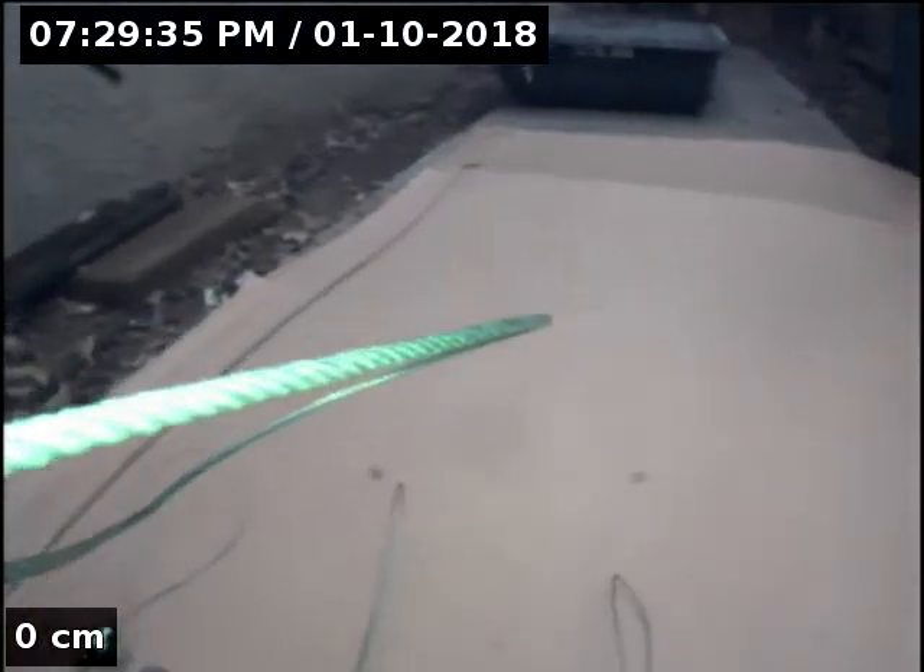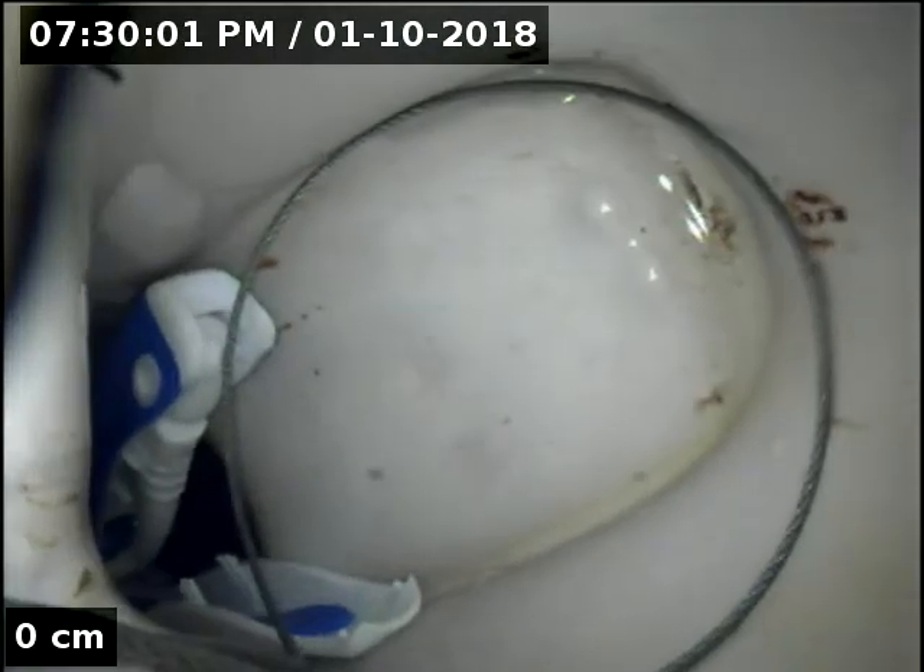We have all three custom-made. We have this little snare that's attached. And right here, as you can see in our camera that we're currently on, we have the micro drain hooked up right now with another tool, the same one you're seeing on the ground there. What we've done is, inside this toilet, we've pushed down a toothbrush, mimicking somebody losing something inside a drain line. So we're now going to go ahead and push our camera through this toilet bowl. There you can see there's our lost toothbrush. We're now going to go ahead and see if we can maneuver our snare guide tool around this object and retrieve it out of the line.